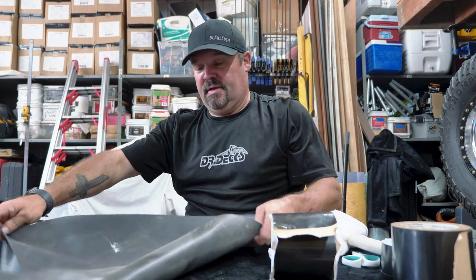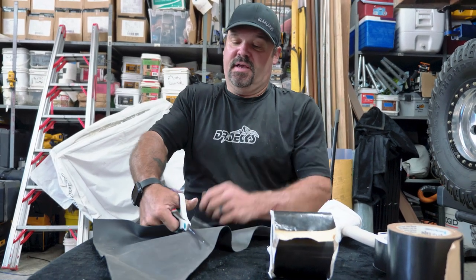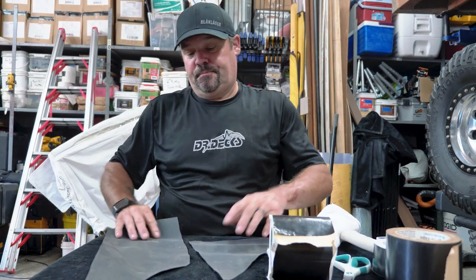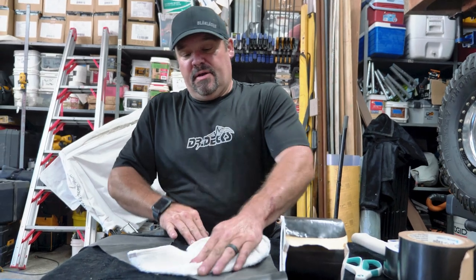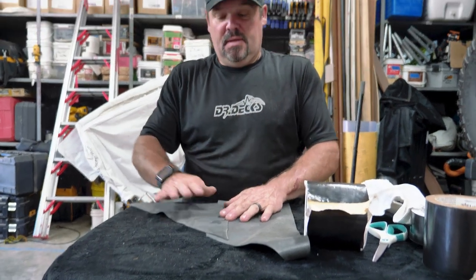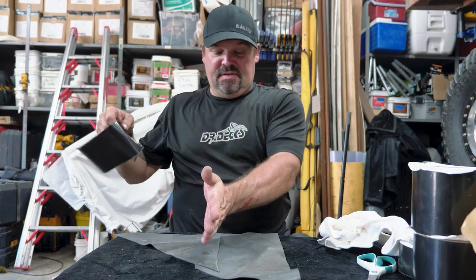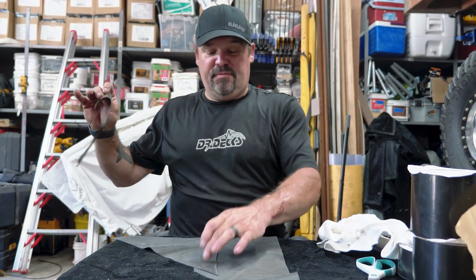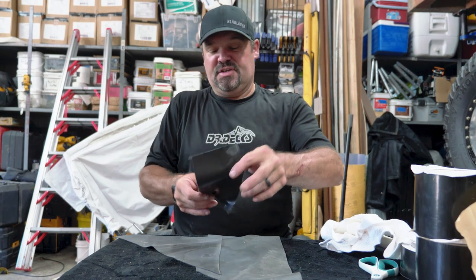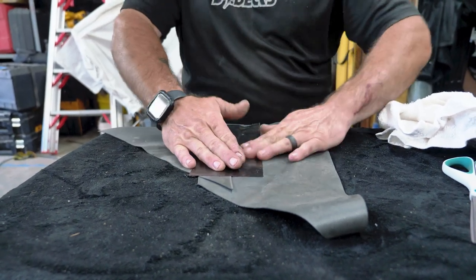I have a large piece of EPDM pond liner here — I'll just cut a piece off. We use this stuff for waterproofing our decks. If you have a seam or you're overlapping seams, the pond liner has a little bit of a silver coating, so I like to wipe that down before applying the tape. Once the seam is prepped, I take some 3045 and apply it right over the top of the frame or joist overlap — we've already caulked and stapled it down, and now this is our final layer of protection.